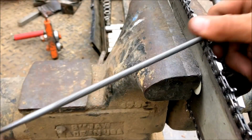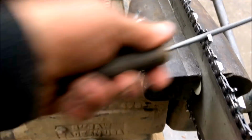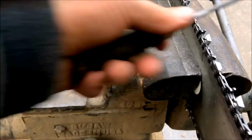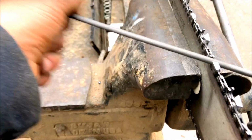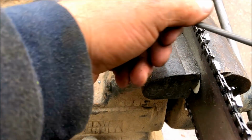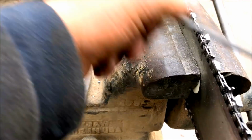When I get my saw right, there's going to be wood hitting the ground. So I don't let anybody rush me into putting a crappy filing job on a saw, especially when it's warm outside, because all that crappy filing is going to do is get you wore out. Then you're going to do a crappy job of cutting, and you're going to be fighting it, and the tree's going to be setting back on you, and stuff's not going to be going predictable. So get your saw right. It starts with a sharp, smooth cutting saw, always.